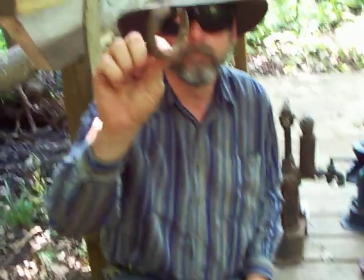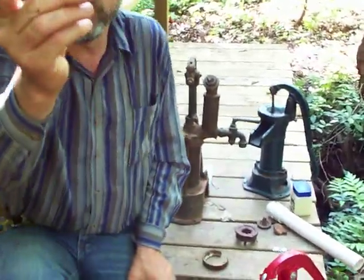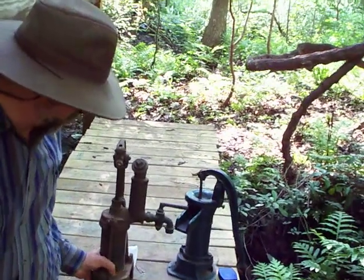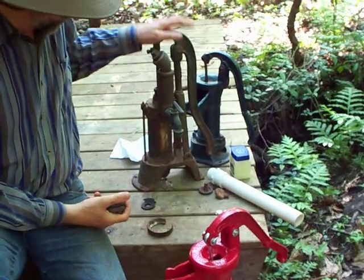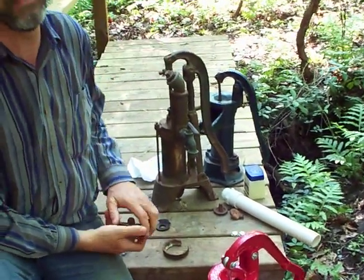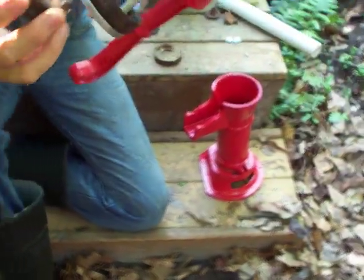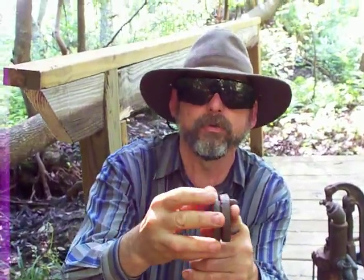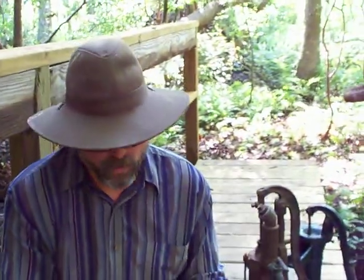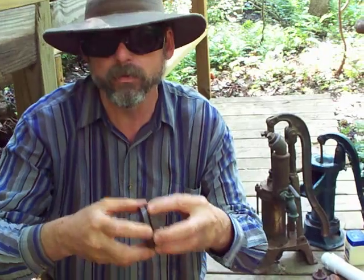This is a cup leather that came out of this pump here, and this is what's left of the valve leather from out of this hundred-year-old pump. The reason this pump is not getting installed at this time is because I did everything in my power to carefully get this apart to change out the cup leather — and there's what happened to that cage. The top broke off of it. Never, no matter what, when you're changing your leathers out, never stick a screwdriver in there to turn that — it'll just break them off. I actually had this in a pipe vise holding it steady, and still even with it in a pipe vise it broke. That's how fragile they are.